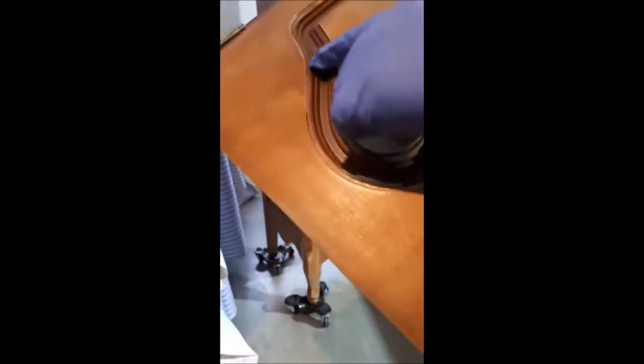And in here, anywhere where there's a really intricate piece that would take a lot of really heavy duty, delicate sanding, I use a Fusion product called Ultra Grip. Ultra Grip just gets painted in and it allows the paint to stick to it. It has to dry for 12 hours. So this has already been prepped and dried, and the rest of it's been scuff sanded. When you scuff sand, what you're doing is you're raising the tooth on the piece a little bit so that the paint will stick to it.